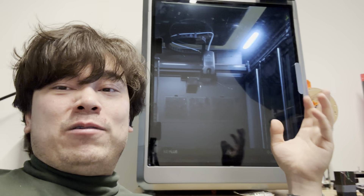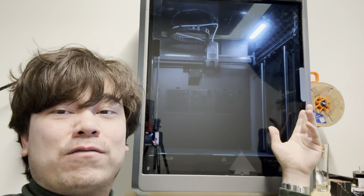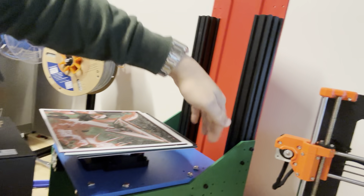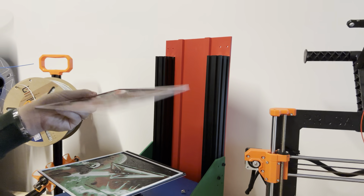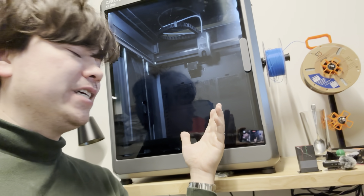That extra melt zone means increased print speeds, but it's a trade-off — you have a little more waste during multicolor filament changes. On a machine this big, I think I'd value the higher flow rates more than the decreased waste. You have to think about your use case. On every AMS-style system you're going to have a lot of waste with color changes. This machine is really good for automatic filament selection, printing multiple parts, Hue Forge prints where they're relatively small and flat with limited color changes, or batch printing where you're printing a massive number of duplicate pieces on a large tray. Your per-part poop and purge waste will be less — one little part produces the same amount of waste whether you print one or 60 of them on a single tray. You just have to be smart and work within the constraints of the machine to do multicolor printing without producing an enormous amount of waste.